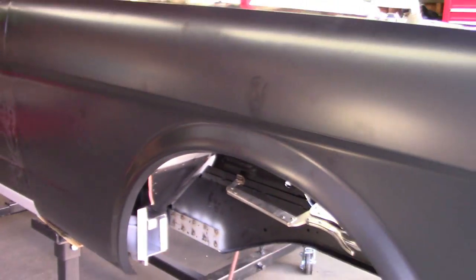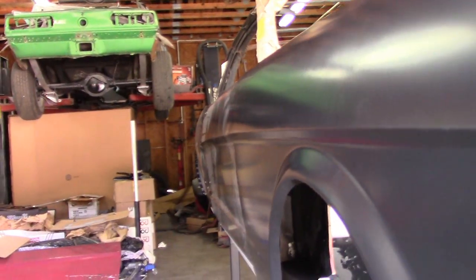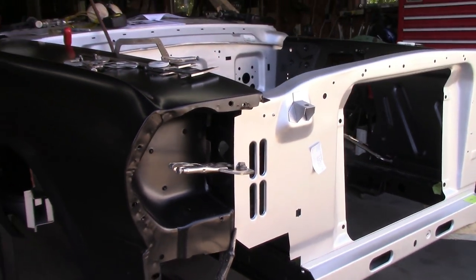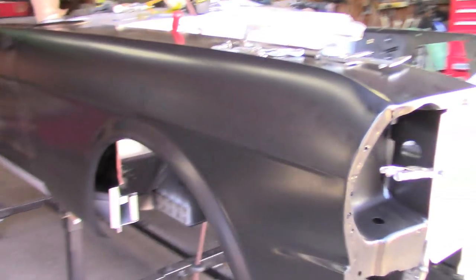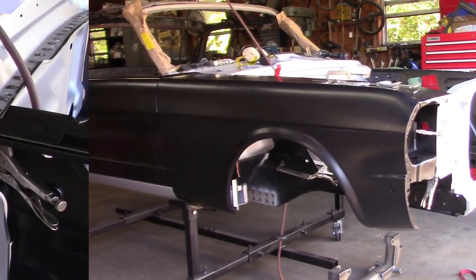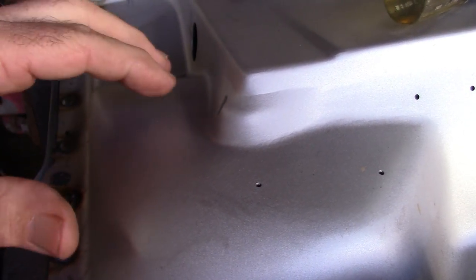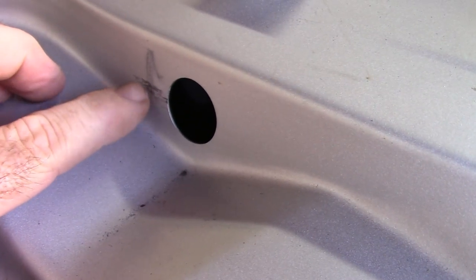Where I have a silver marker right there, the apron is coming up and hitting the bottom of the cowl - it can go up just a little bit by trimming that. The reason it's an issue is this corner - there's a light gap between the firewall and the cowl. If I try to raise this to close that gap, it's going to hit the upper half of the cowl flange, so I'll trim that and allow everything to move up slightly. There's still going to be a gap but a lot can be addressed with tweaks. Looking down the fender, it lines up pretty close to the door.